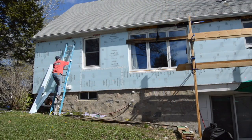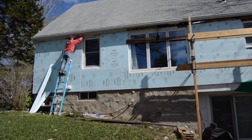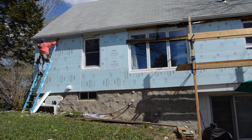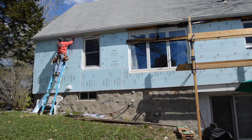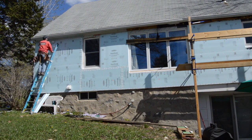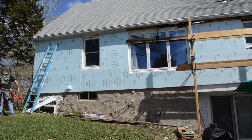At the top of the wall, I pieced in skinny rips to fill in tight to the soffit. When I tear off the roof next year, I'll cut off the rafter tails and seal the roof-wall intersection with peel and stick membrane, sealing it to the Tyvek. The soffit fascia will then be boxed out as illustrated in other Pro Tradecraft videos and animations.